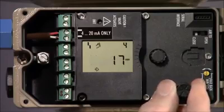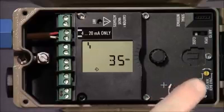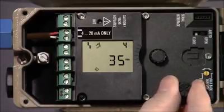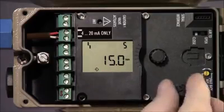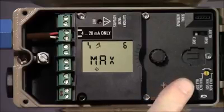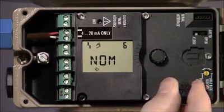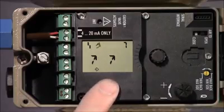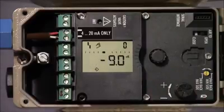Parameter 4 is the pin position and is changed to 35. Parameter 5 sets our travel and is kept at 15mm. Parameter 6 will change to nominal to use our 15mm stroke rather than the valve maximum. Parameter 7 sets our operating direction to increasing-increasing.